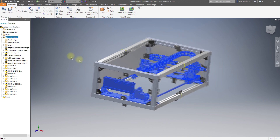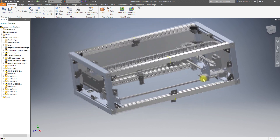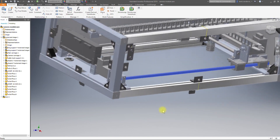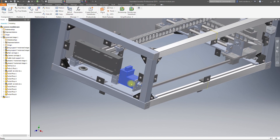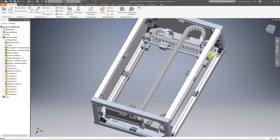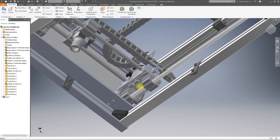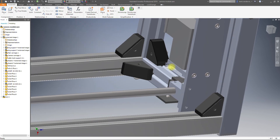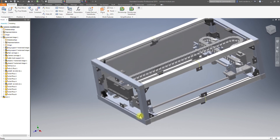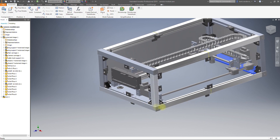The mechanism is contained within a box built from aluminum extrusions and cover panels. The mechanism moves a camera along two axes. Two motors are used to drive those axes and cable carriers carry the wires to the camera and to the motor. Inductive sensors with steel targets are used for homing.